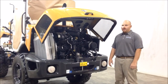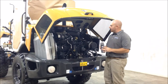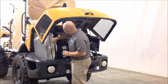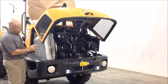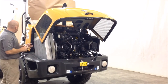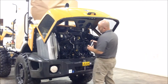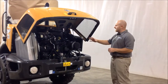So we're ready to coat this thing — we've got a good clean and dry machine. The first step of our coating process, we use the aerosol can. We're going to go around and hit all the nuts and bolts, hydraulic fittings, weld joints, and all the little tight areas — like for example this plate where the radiator is bolted in. The coating is actually going to whip in behind those washers, bolts, and nuts and seal those areas. So we're going to go around the whole machine, hit the lug nuts, hit plates like this, all the nuts and bolts, hydraulic fittings, and these electrical connections. We do that before we use the quart form of the product — it just helps to seal all those tight little areas a lot better.